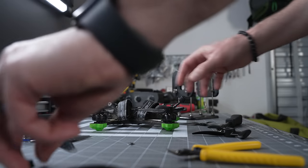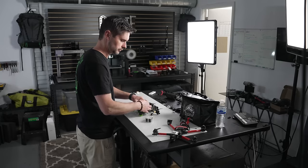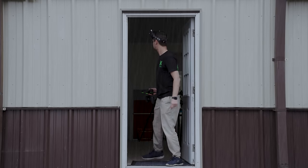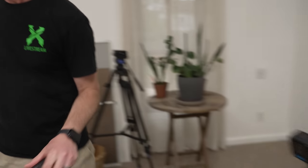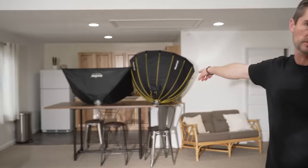You might notice we switched to an FPV drone with five-inch props instead of the seven-inch quad we started with. The smaller props weigh substantially less and should, in theory, be more likely to survive. We also went with a smaller pack to decrease the weight of the drone and the speed needed for liftoff. We can't do the test outside because it's windy and raining — so we've set up a couple GoPro cameras. One GoPro on 240 frames per second, another one sitting under the drone looking up as it takes off, and an iPhone in slow motion as well.